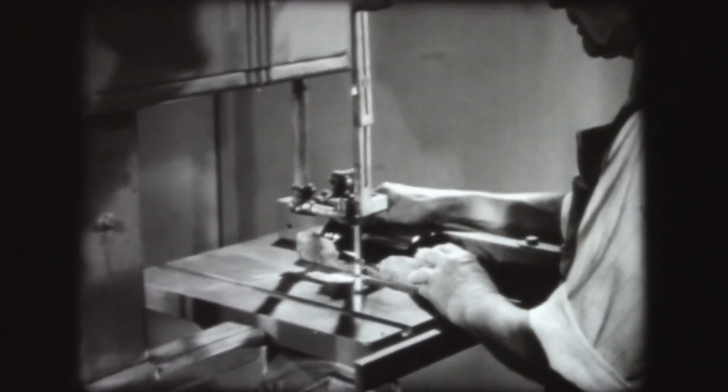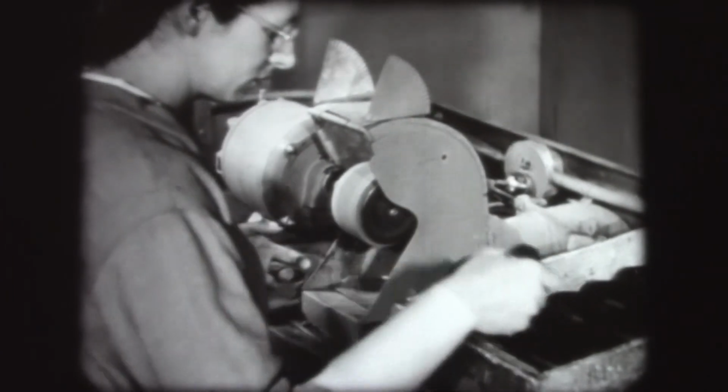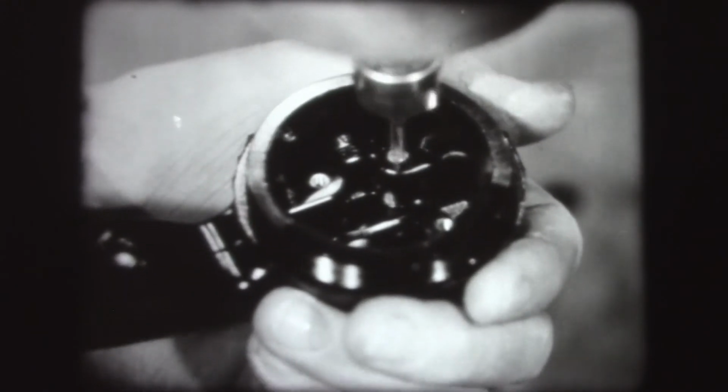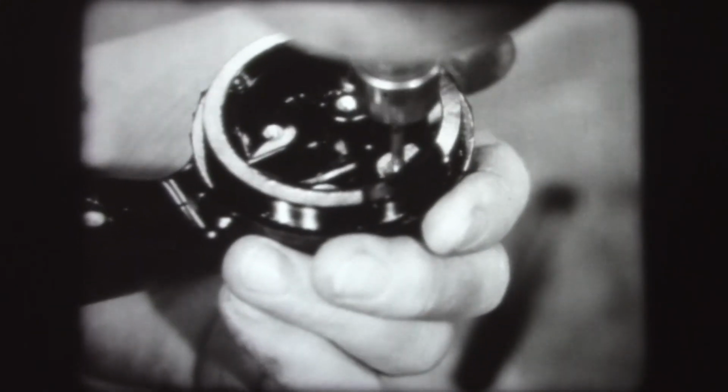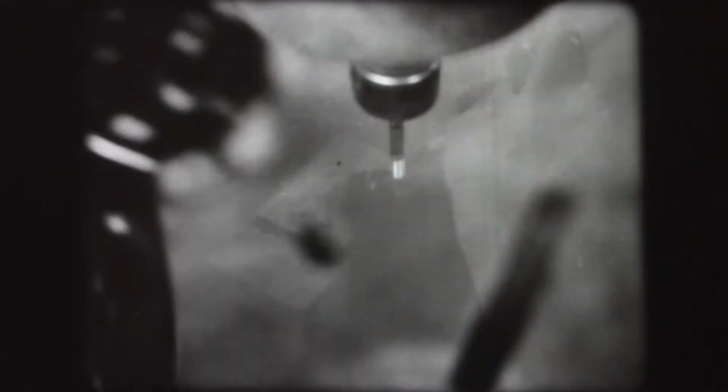First, the gate is cut off with a bandsaw, using a blade suitable for cutting plastics. A drum sander is used to remove some of the flash, care being taken to maintain the contours of the piece. A drill press with a tapping attachment is used to retap all the threaded metal inserts. Additional flash is then filed, sanded, and scraped off by hand.